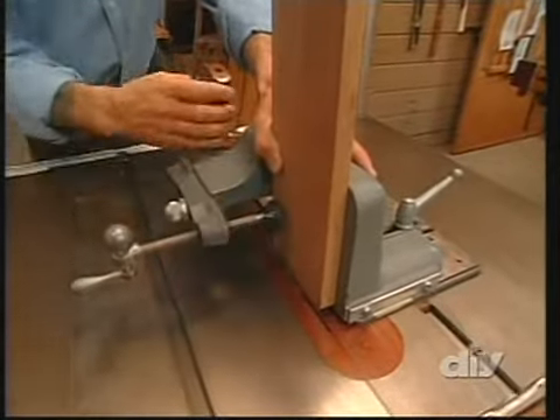To be in keeping with the arts and crafts style, we're going to put a bevel all the way around the edges of the exposed tenons. This is a great time to do this — it's going to be a lot more difficult after the table is glued up. To accomplish this, we use a bevel bit at the router table with a bearing on top. That way we can freehand the piece through and get a nice subtle bevel all the way around the edges.